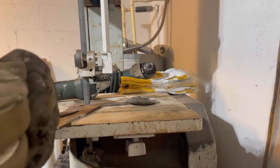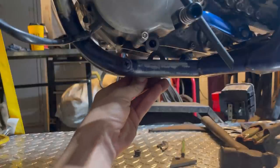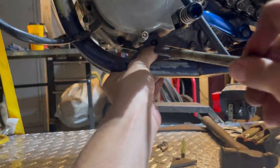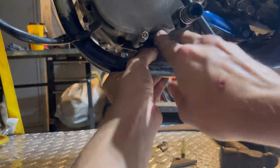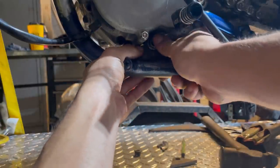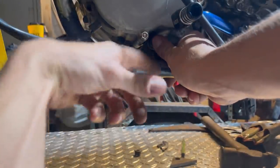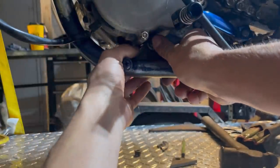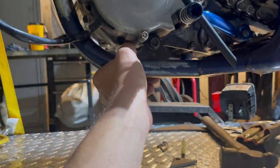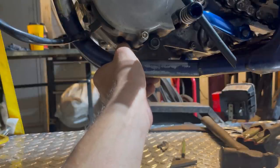Second mount. Let's go ahead and give it a shot. This thing's still kind of hot. It's okay. All right, it actually seems like it's going to work out nicely. And this one is not directly touching up against it. It's less than an eighth of an inch of a gap, which I kind of like because that's going to give me a fully penetrating weld. So that's just going to sit there just like that, and then we'll tack it in and weld it out.